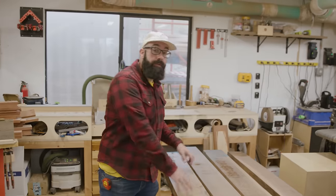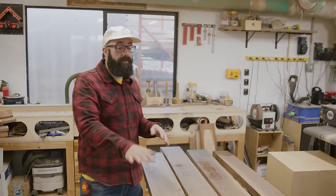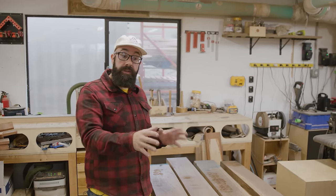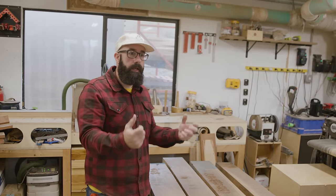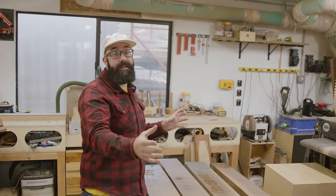The table is gonna be 3 foot wide and 4.5 feet long, or 54 inches. It's gonna be 30 inches tall, which is pretty standard. I'm gonna make it all out of 1.5-inch material. And I wanted it to be really thick because this design has a tendency to rack if you don't make it strong enough. So it's gonna be a really beefy base, but the way we designed the splay, it makes it look like it's not so beefy.